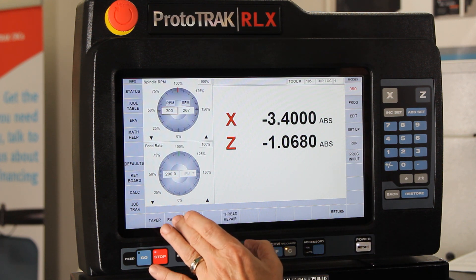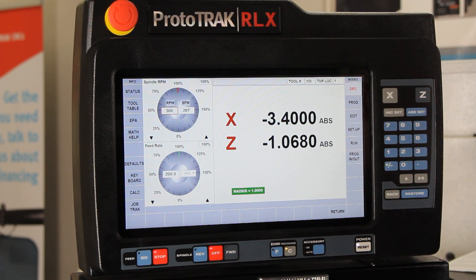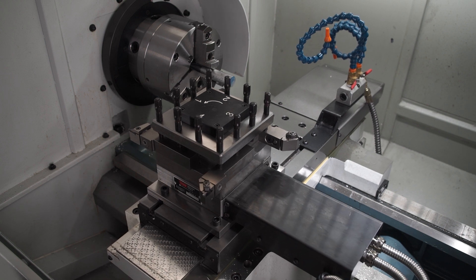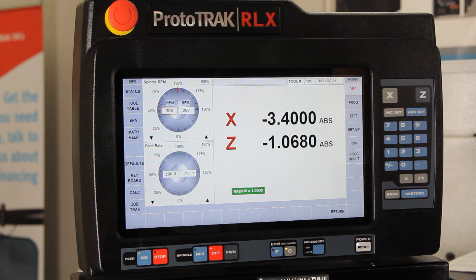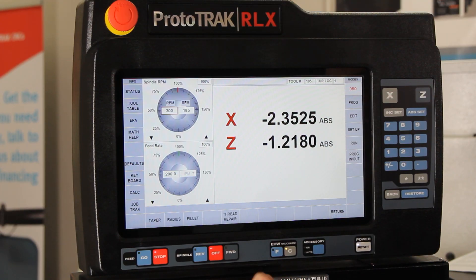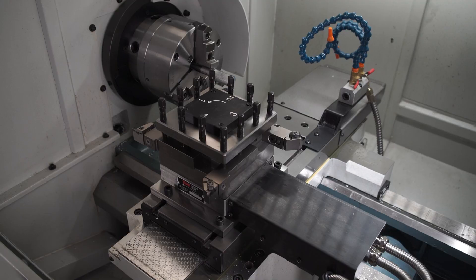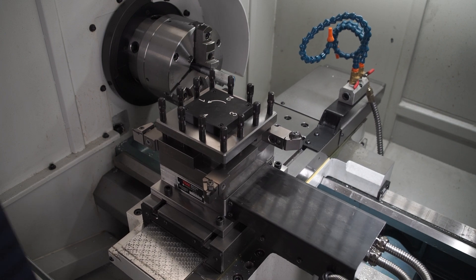The same thing is true if I want to cut a radius. I'll put a large one in so you can see it — a one-inch radius. As I turn the hand wheel it cuts 90 degrees of radius from start to finish and disconnects the hand wheel on both sides. You can do this with either the fine or coarse feed: fine feed uses the X-axis hand wheel, coarse feed uses the Z-axis hand wheel. Last, you have fillet, which is the exact same thing only inside out — an inside radius. It also does 90 degrees, disconnects at both sides, and can be done at any value.